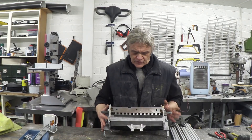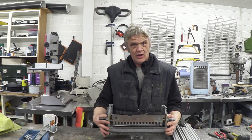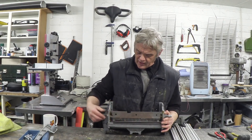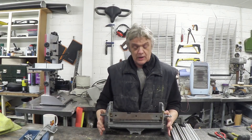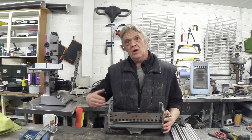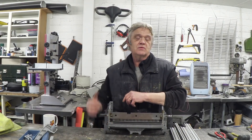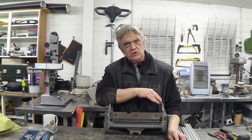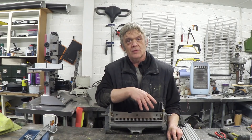Now when I look at these things I try to work out how I want this to work. If I look at this, it needs to be in that orientation so that bit is facing out towards you. The paper gets fed in there and then we punch that up and down. So clearly we need something to hold it there, something to hold a table, and then something we can turn a handle against. Now if I wanted to cut those out of solid material that's actually quite challenging, but like I say I've got a load of this. So the first thing to do is attach this to some of this so that I can build a framework around it.